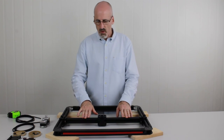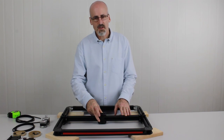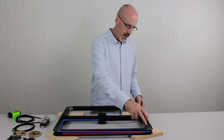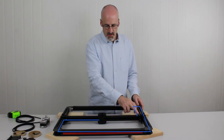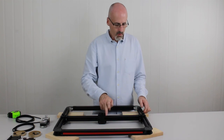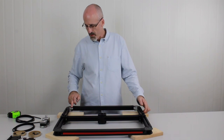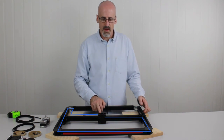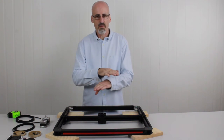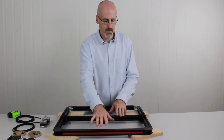There are two drive belts, one on each motor. One starts on one side of the X carriage and moves through a series of pulleys around the outside of the frame and back to the gantry and back to the adjacent side of the X carriage. The same on the opposite side, it goes the other direction around, back down to where the drive motor is mounted, back up to the gantry and across to the back. These belts are on two different planes, which allows them to pass over the top of each other inside the T-slot on the front of the frame.